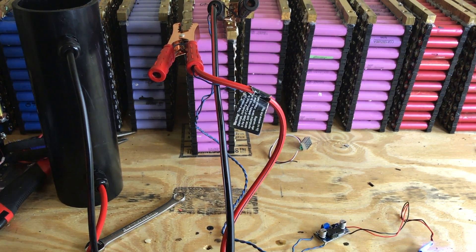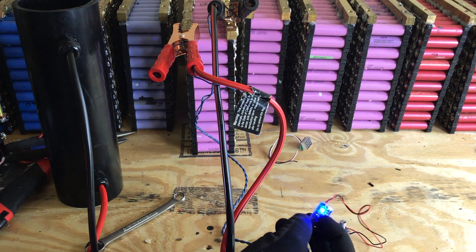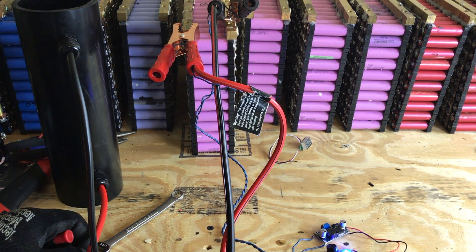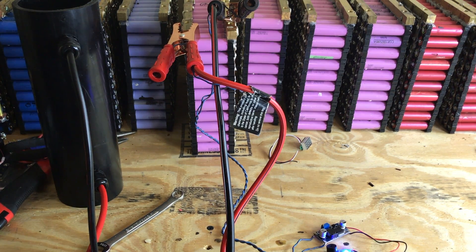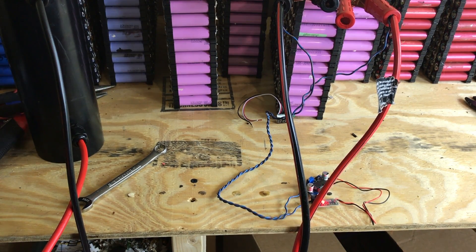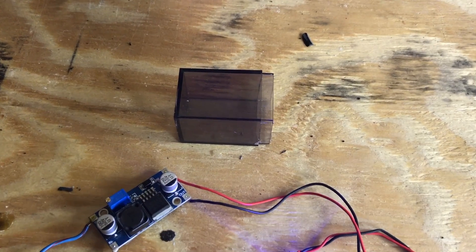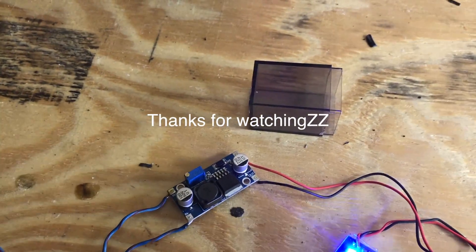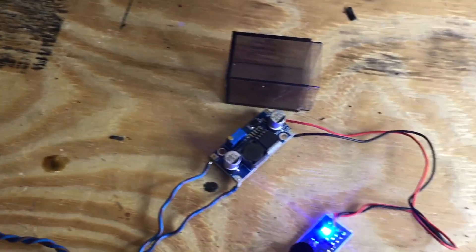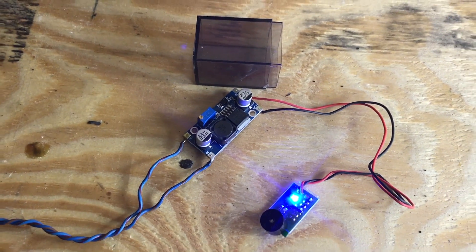When you connect to your battery, you will see this green light right here, meaning it is discharging and the battery is still above the desired voltage. When it turns red and is blinking like that, it means your battery has reached the desired voltage — take it off immediately. Don't leave it there, it will drain your battery. With this casing, make sure that you put all the electronics in the case and seal it up so that it should not cause any shock. Thank you.